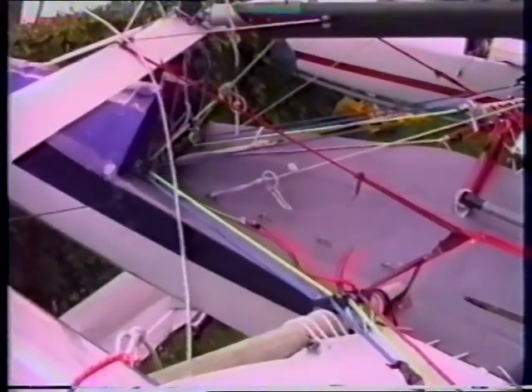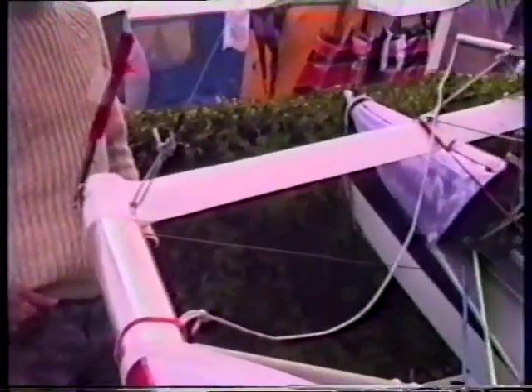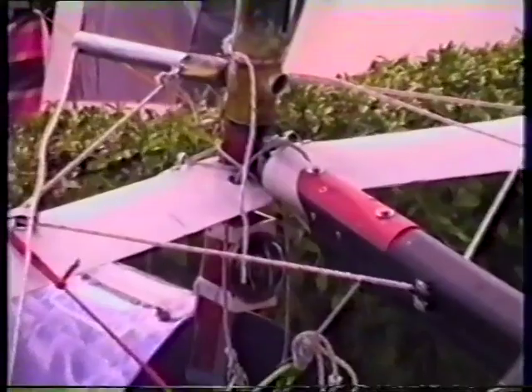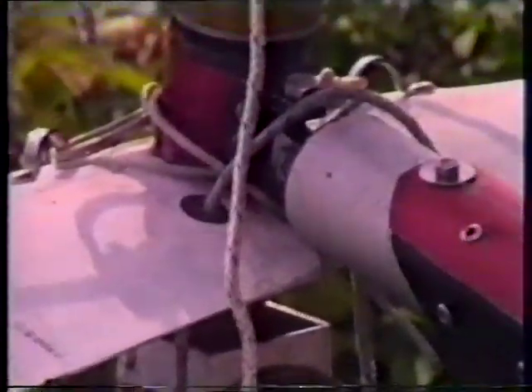And then pull it on again as it gets out towards the side of the boat. The interesting thing Clive has done is his wing support bar is faired out of carbon fibre and runs into the mast base at the same point at which the gooseneck is attached. He runs his outhaul down through an eye in the side of the boat — what you'd call a wing support. And from the end of the wing, he has an understay wire that runs right down to the boat and through the side of the boat.